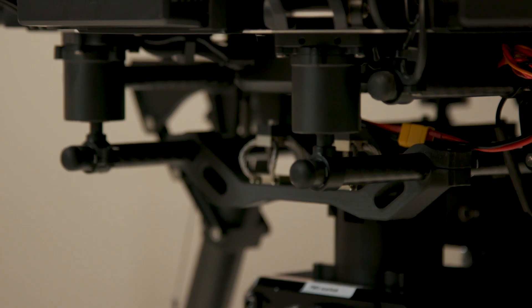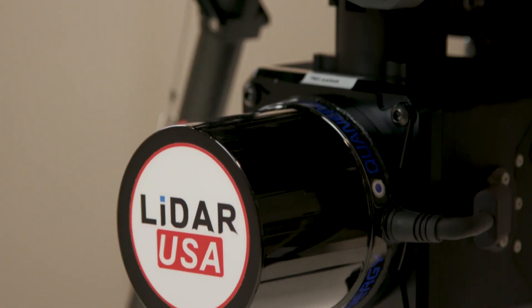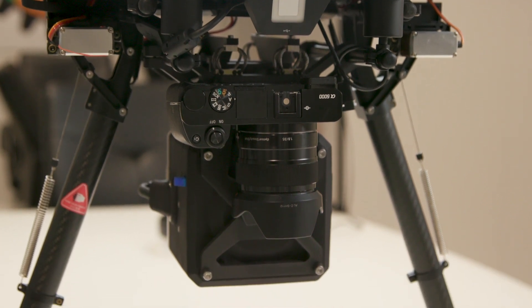Now with the LiDAR USA system, they're very simple and easy to use. The IMU and the GPS data is geo-referenced into the camera itself. So in terms of post-processing that data, even in PIX4D, it's very straightforward. Processing the LiDAR data is also simple. The Quanergy M8 laser is an eight-channel laser and does about 440,000 points a second, which flying at around five metres a second gives you around 200 plus points per square metre.